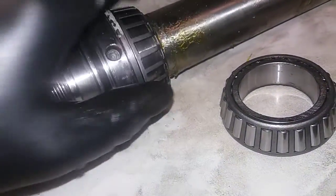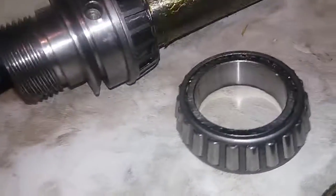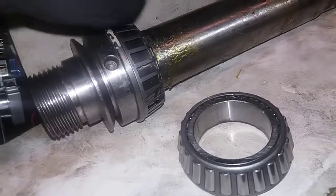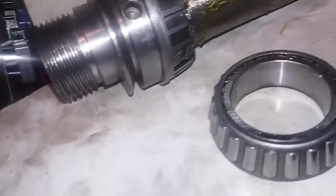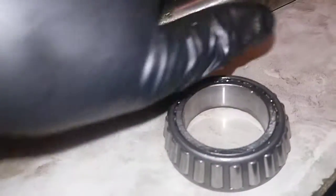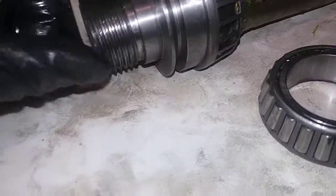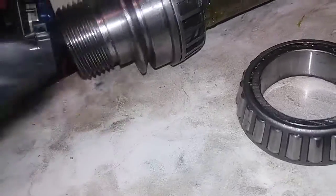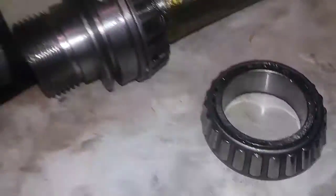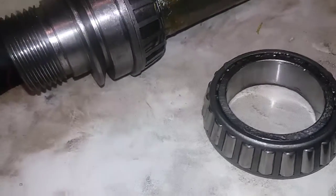I have an arbor I can cinch it down with and I'm going to try to put a certain amount of tension on it. Even after I flooded oil through it to flush all the chips out, I was worried about the bearings. They are hardened material, so little chips probably aren't that big a deal, but it felt off. Maybe I over-tightened when I put it in, or maybe it's just a cheaper bearing - it's like a first time I've done anything like that.